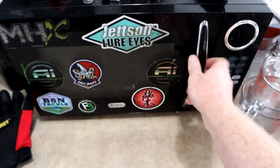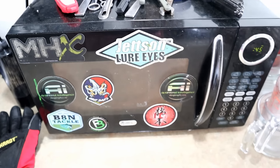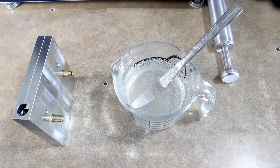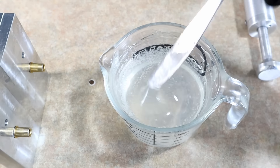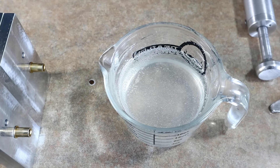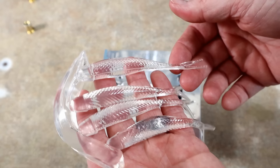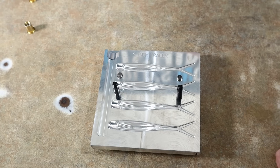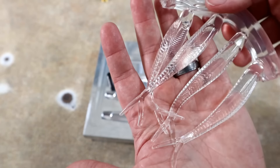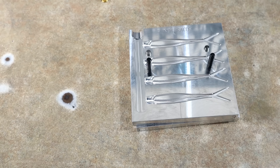The plastic has set up. We'll start with a 45-second remelt and see where that gets us. Everything is remelted — I've stirred some bubbles in so we'll throw this in the vac chamber to get those bubbles out. Round three passed the test after one full actual remelt cycle — no discernible difference. This is the fourth remelt from the same cup, and yeah, no discernible difference. It has passed the remelt, recycle, reheat test.